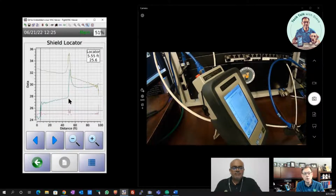Gotcha. And I think this also points out, you mentioned the step TDR, these upper traces here actually represent measurements at many more data points than the typical impulse TDR. Therefore, they can find problems that might be overlooked by a typical impulse TDR. And you can see here a difference in the trace. The impulse TDR, while it shows us a spike here that we know shouldn't be there, you can't really gauge the intensity of it until you look at these step TDR traces, right?